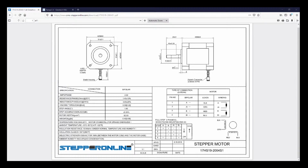So let me check on the chat for a second. Yeah, regular vertical lines across the surface of the print. So if you're printing a square, you're seeing these little shaky lines going up it. I think you might also be able to deal with it with slower speed. But I'll have to order a 0.9 degree stepper or start swapping them out of one of the Enders and putting them in. So let's see what we got here. Wow, we're 2 hours and 18 minutes in. Or an hour and 18 minutes. I'm sorry, I'm not awake today apparently.